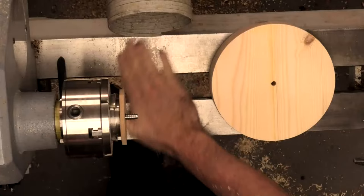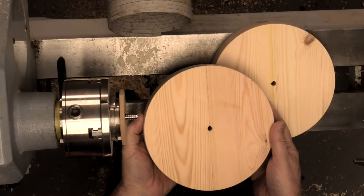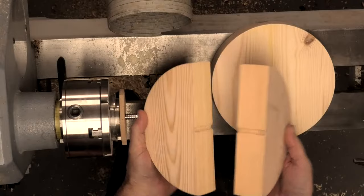Nicely finished. Once you've done that, then you're going to go to the bandsaw. And I would definitely recommend a bandsaw, not a table saw for this. It's a little bit too close to your fingers with a table saw. But then cut back down, put a rule and a pencil line across there, cut back down that glue line. So what you'll end up with, two pieces that are nicely finished on the edge and on these faces,